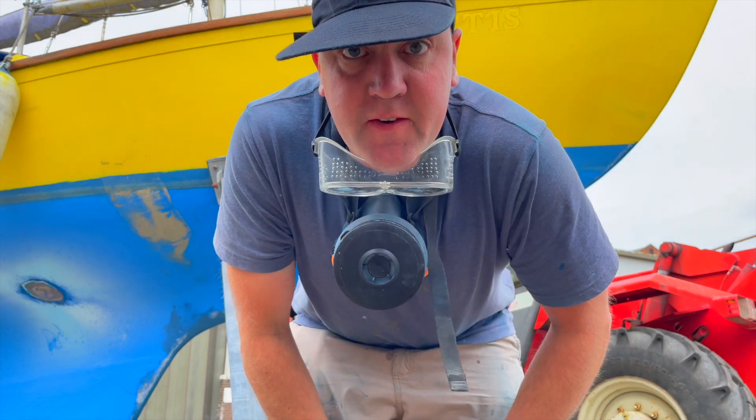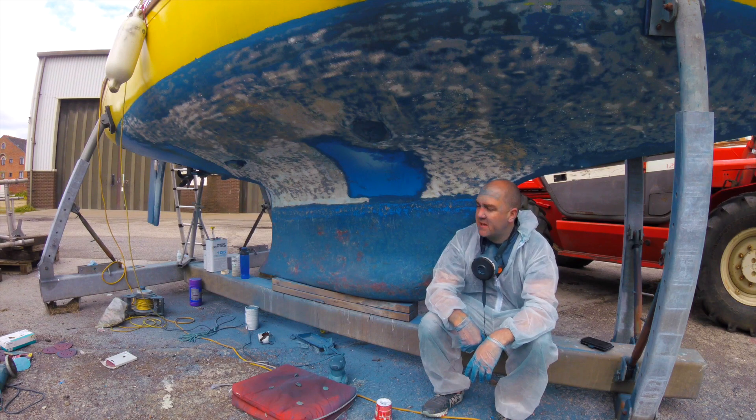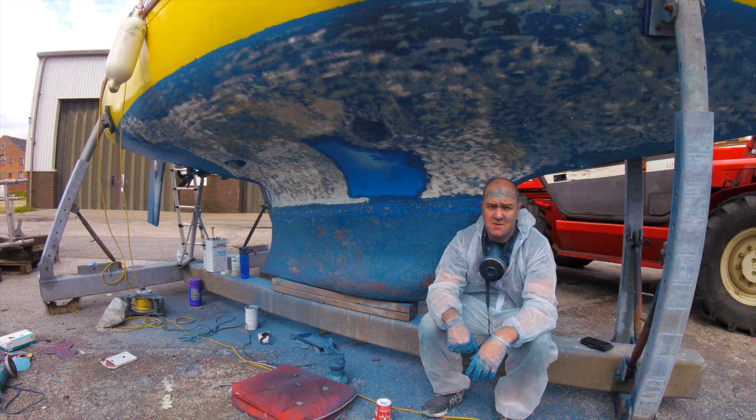What hard work this is — I feel like I've gone back to the beginning, where I first bought the boat. I've had to sand right the way back to the gel coat again. The anti-foul was just peeling and flaking off here and there, and you couldn't just scrape it — you've had to really dig in and sand it right back to get a smooth finish again.